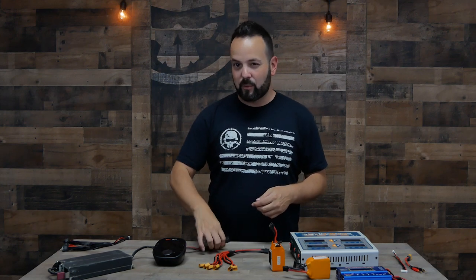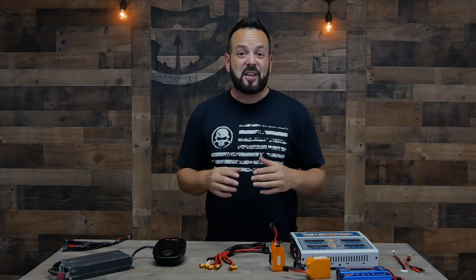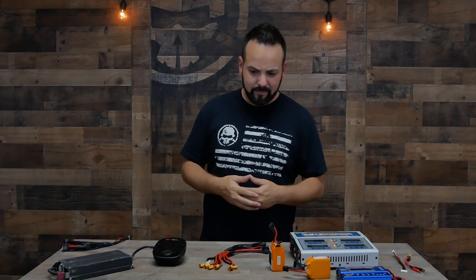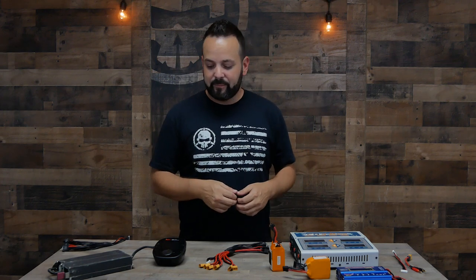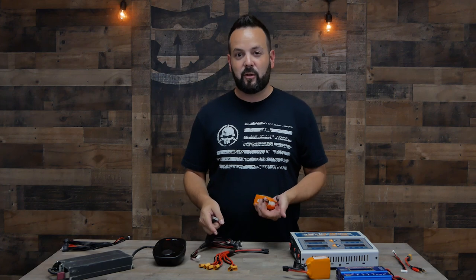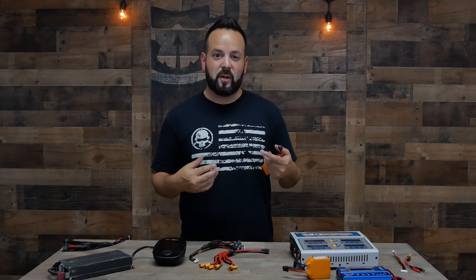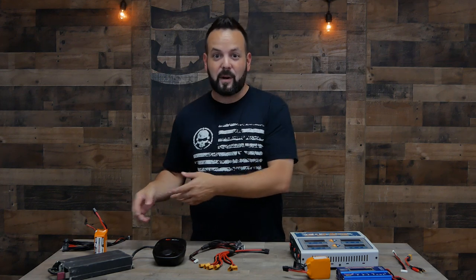You can probably get away with a little more voltage difference on cables since the wire is rated for higher current, but in general keep batteries relatively close to each other. There's no reason to have a fully charged battery and a fully dead battery together anyway — the full one doesn't need charging. Avoid mixing one that's almost charged with one that's really low. As I showed you with the ISDT charger, as soon as you plug in a battery it displays the voltage of each cell, so when parallel charging I take each battery one at a time, plug it in, check the voltage, and if one is way different I set it aside and charge it separately or with another battery at a similar voltage.